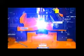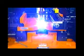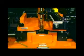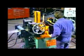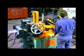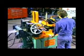Now that we have successfully aligned, clamped, sheared, and fit up the strip ends, the lower backup bar raises into position. The torch is brought to the front edge of the material. Once in position, the arc starts and the torch traverses across the strip at weld speed. Since the torch drive is by a DC motor, the speed of the traverse is adjustable depending upon the strip thickness and the penetration required. The machine is then reset, opening all clamps and returning the machine to its original starting position. The process line is now ready for operation.